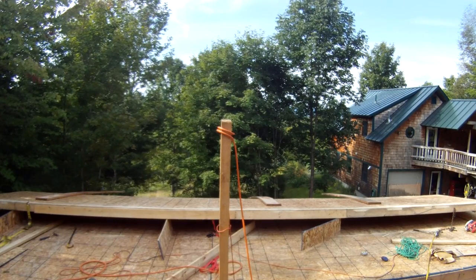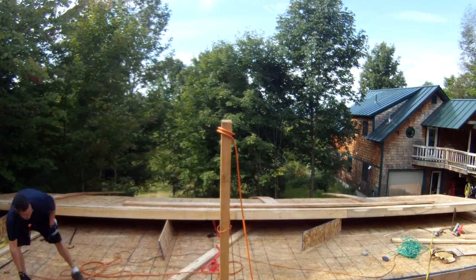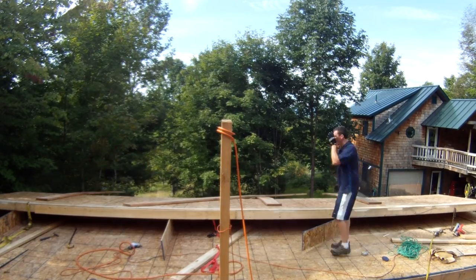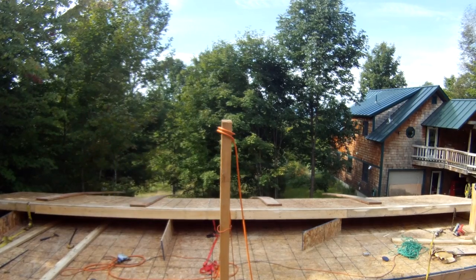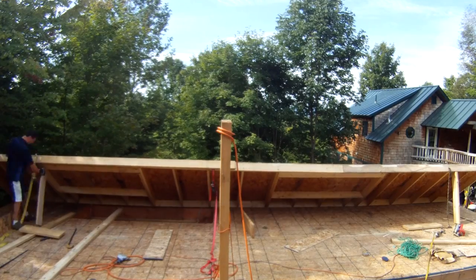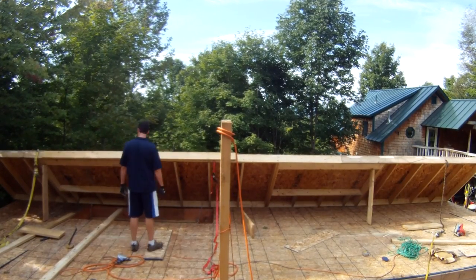I built the entire wall and realized it was way too big to lift up. The idea behind the two-by-12s hanging over the edge is that they're effectively picking up weight on this side of the wall because they extend past the edge, making the wall effectively lighter. That's why I was able to actually lift this thing.